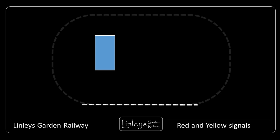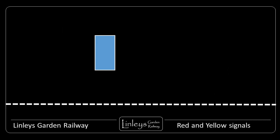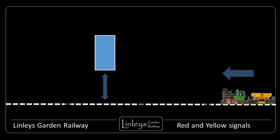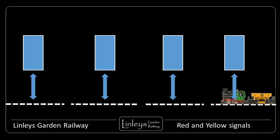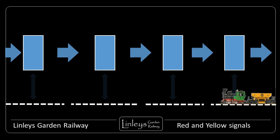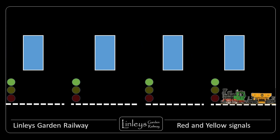We have a long line of track. This track could be a long continuous loop, but it's easier to see it as a long straight piece of track with the right end as the start and trains traveling towards the left. We'll chop this track up into block sections. Each block section has a control module. Every module links with adjacent modules, communicating and permitting movements of trains according to automatic regulation and any manual inputs from the mimic panel. This is just a single line of track for one-way working with no junctions, keeping it simple.